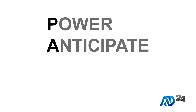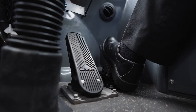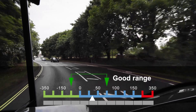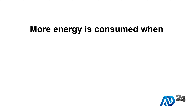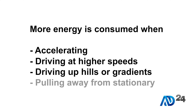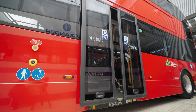The word PACE is a good way to remember how to drive the bus most efficiently. PACE stands for Power, Anticipate, Coast, Ease. Power: the accelerator pedal directly affects how much energy is consumed from the batteries. Monitor the power bar on the dashboard when it's safe to do so — this is a useful guide to help identify energy used and recovered whilst driving. Try to keep the white triangle in the middle of the power bar. More energy is consumed when accelerating, driving at higher speeds, driving up hills or gradients, and pulling away from stationary. Constant use of high power drawing components will also reduce the potential range of the bus.